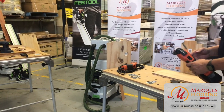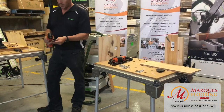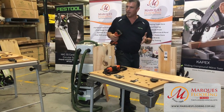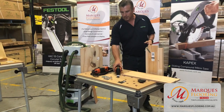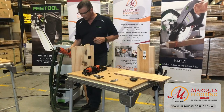Applications include cutting holes for vents, power points, hosing, bathroom work, and much more. The machine is not only designed for cutting — it also has sanding capabilities. With all oscillating tools there's a high decibel level, so ear plugs or ear muffs are always recommended, along with safety glasses.